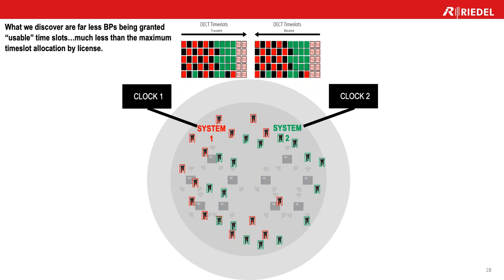So in this case, you have to account for all of the belt packs. And you also have to account for the fact that there are some systems out there that use more than one time slot. Right. But FreeSpeak is one. Yeah, exactly. But from a Bolero point of view, obviously there is the advantage that we know our performance will be better because we only use one time slot. If we start to approach any limits, the FreeSpeak standalone is going to be the one that hurts more because they have to use two time slots. So if we're both co-located in that near field environment, in that perfect storm, we have to consider that FreeSpeak is going to take up two. Does it affect us? Not really. Does it affect them? A lot more.